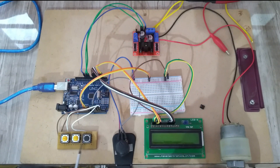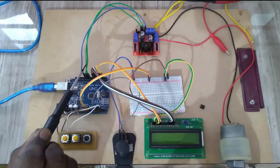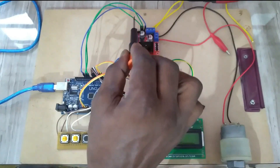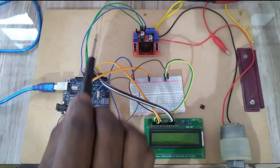These are the three switches for forward, reverse, and stop. This potentiometer is for changing the duty cycle. This button is connected to A1, this one to A3, and this one to A2. This wire is connected to the ground of the Arduino Uno. Arduino Uno pins 8 and 9 are connected to IN1 and IN2 of the motor controller.